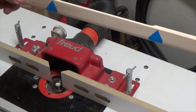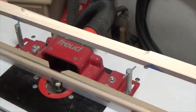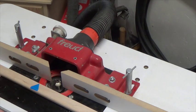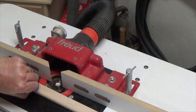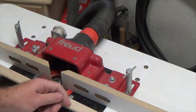There we can see the tape marks, and on the back end a very nice little finger pull. Those little extras make your project stand out from other people's work. After removing the tape and a bit of sanding, we're going to move ahead to getting the hinge put onto this display case. The next step is to cut the recesses for the hinges — in this case I'm using one long piano hinge.